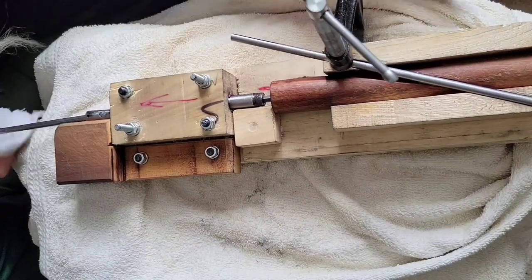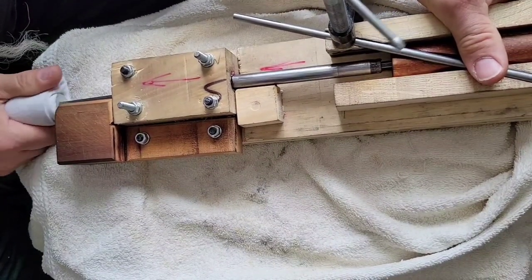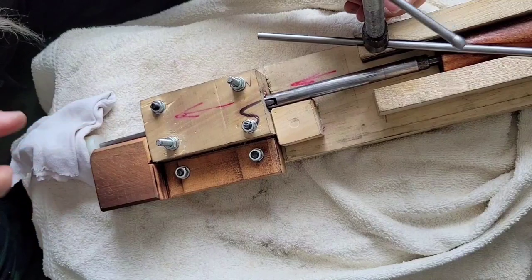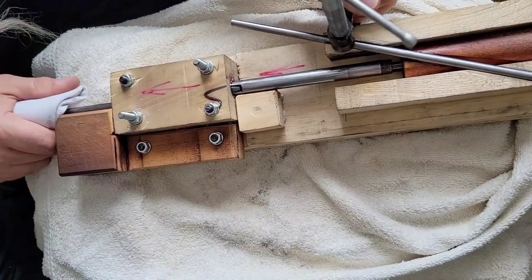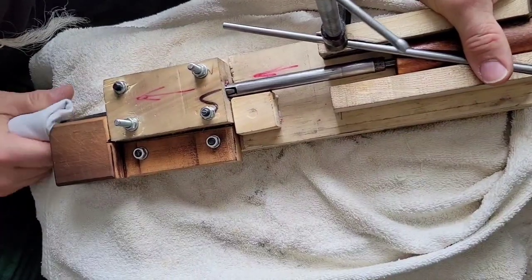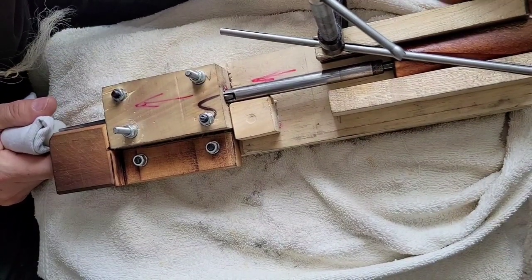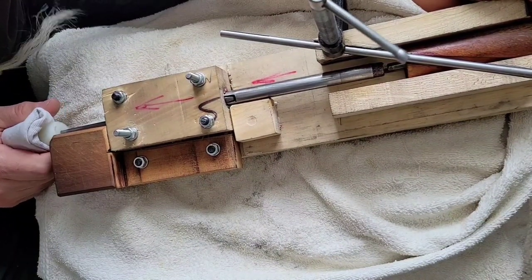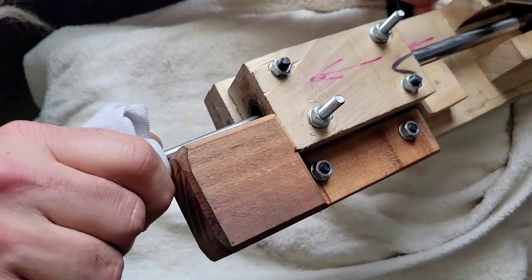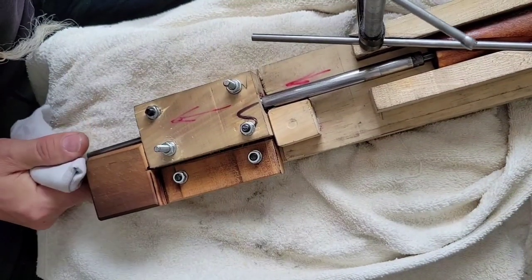I've been at this for a while, and then I took a break yesterday, but I ended up turning this around this way so that I could make it easier to crank this clockwise as I retract the cutter. I'm going to get a couple passes here, and then I'll index — take a few passes, then pull this guide back, this spindle. Then I'll turn this clockwise slightly as I push this back in, and now we're in the next.